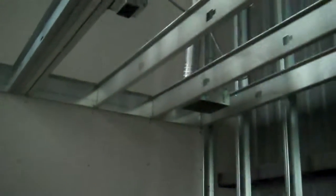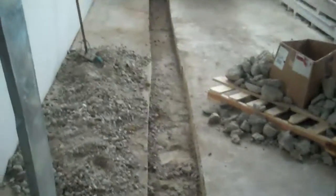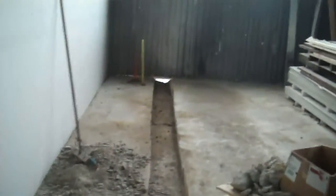So this is the bathroom. We've got planned for a hard ceiling in here. We've got the bath fan installed — it's up and vented to the outside. The in-wall plumbing is finished. Tomorrow we'll be getting inspected so I can start insulating. There'll be an insta-hot underneath the sink. All the backers are in place. Concrete's going back in tomorrow — the underground's already been inspected and passed.